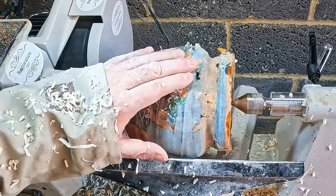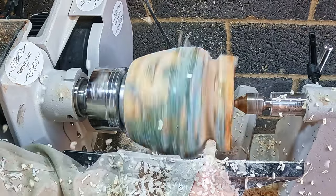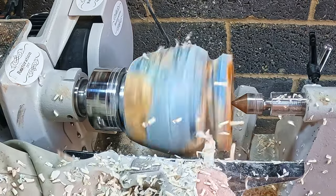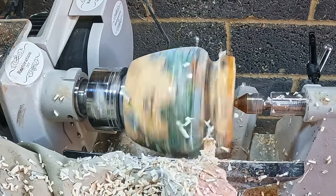As you can see there were still a few voids to fill, but the repair had done what I wanted - the rim had been stabilised. Using the carbide cutter I removed the excess material under the rim, then used the skew to clean up the surface.